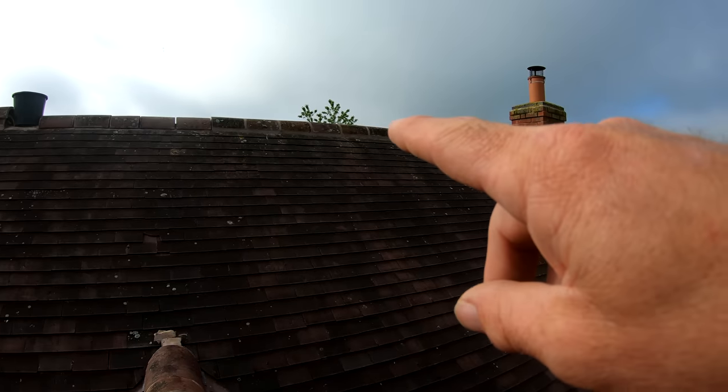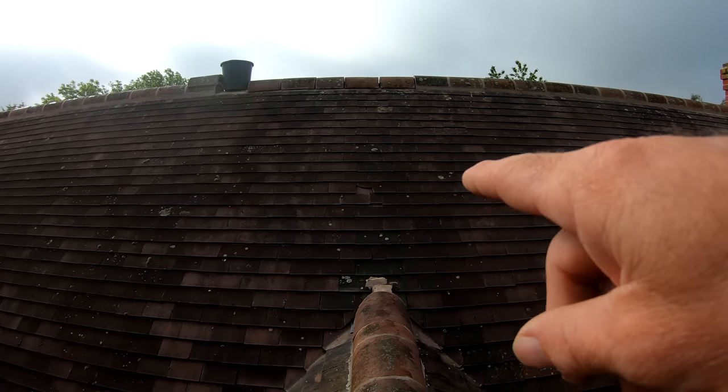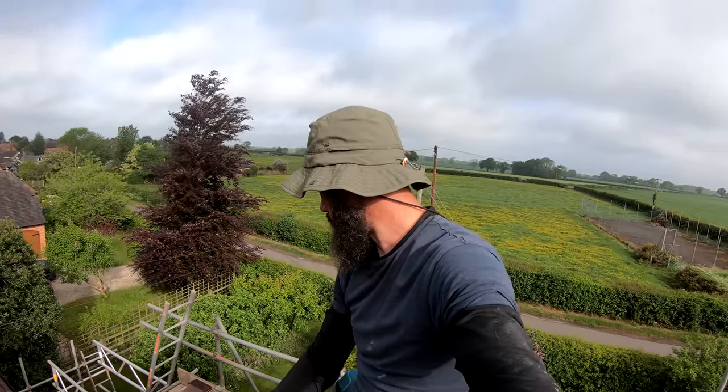A bit annoying — I didn't get them ridges finished yesterday. We had a few thunderstorms come rolling in, nearly got caught out. I had to cover them up, wait for the cloud to blow over, and there's a little bit of pointing still to do — just a little bit. Obviously where I covered it over and when I pulled it off, it was marked, so I had to just point it up and make it all smooth again. Got it all done. All I've got left to do is just these ones here, then I'm going to work my way down. Got a couple of broken tiles there and a couple down in the valley as well. Then the next plan is to get these ridges off and re-bed them. Last thing, we've got this verge to do — I love a bit of pointing on the verge. We've just got to tidy it up here, cut these timbers back just a little bit. That's the plan for today — nice and easy. Let's get cracking.